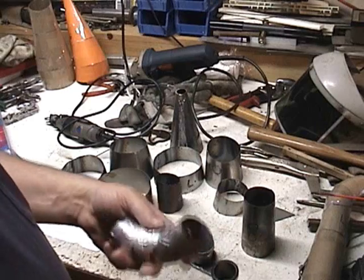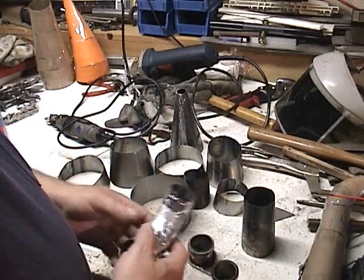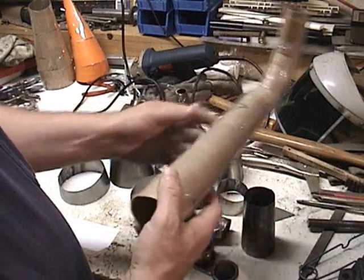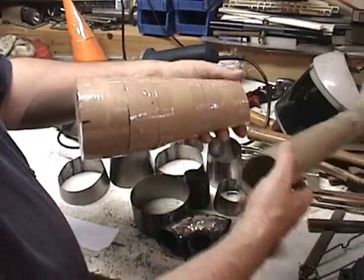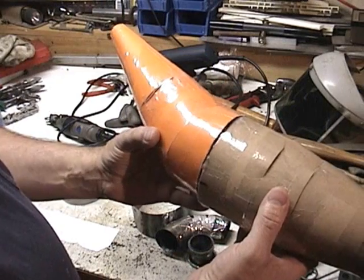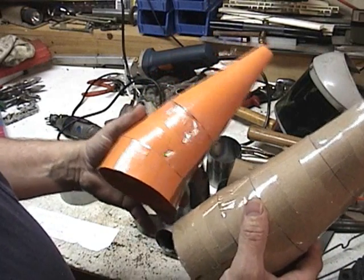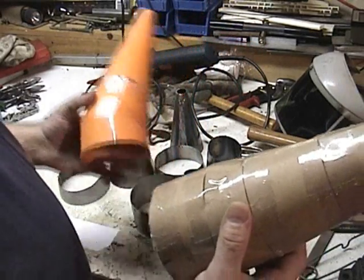What you see in front of you are all the basic parts to make the pipe. There are 16 individual sections that make up this entire pipe. Here's the first section — the elbow. The cones start to diverge from there, then it miters on to what starts to be the belly section. From there you have the converging cones that fit on. I've basically broken it down into three groups, which makes it easier when doing prep work to get all the pieces welded in the right position. You do it in chunks, and that way we can adjust these three sections together for the complete fitted pipe.